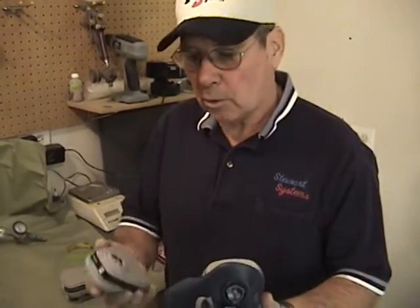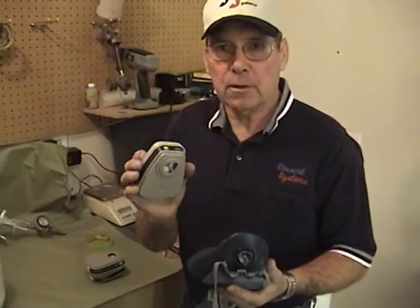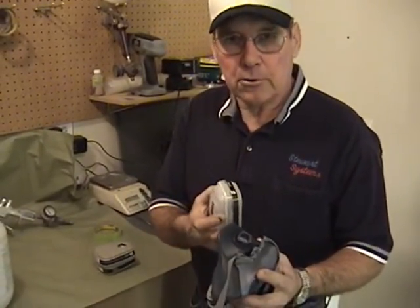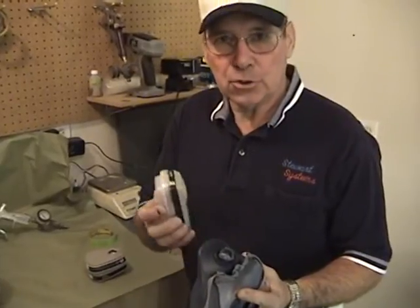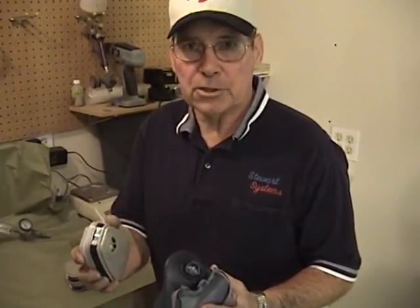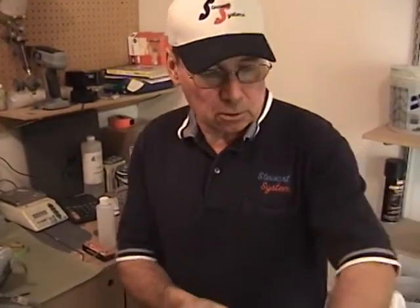On our charcoal respirator, we're installing brand new charcoal cartridges. We want to make sure that the air that we breathe is nice and clean. So if your respirator has any age at all, be sure to replace the charcoal canisters or replace your mask altogether. We're going to put on our Tyvek suit next that keeps our arms covered and keeps the overspray off of us. Then we're going to mix paint.